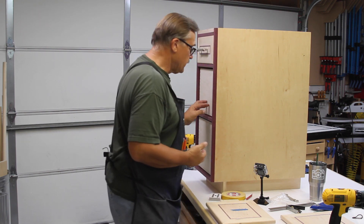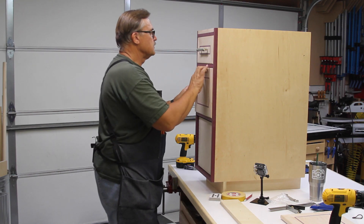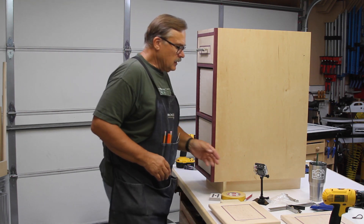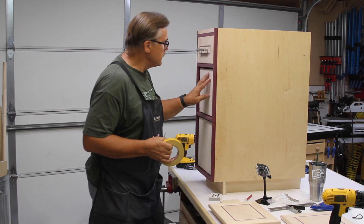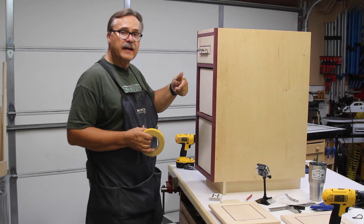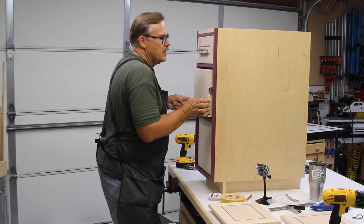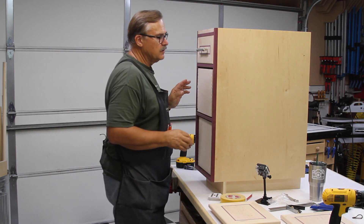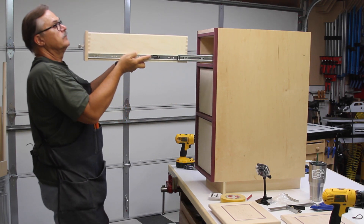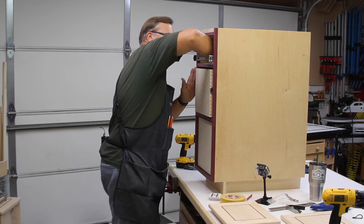This particular drawer front is going to go in the center here. One method that's used a lot is double-sided tape — you stick double-sided tape up here, it holds the piece on, then you pull it out and screw it from the back, and that works really well. But in this particular case these drawers are rather difficult to pull out because they have that soft close, so in order to make this work with the tape I'm going to have to remove the top drawer so I can easily push my drawer out when I need to.